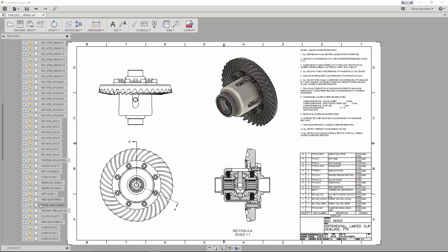If I want the outside gear final drive to not appear in the view but still appear in the parts list, I can hit the light bulb next to the component — it becomes hidden in the view but stays in the parts list. Hitting the checkbox will change the parts list and remove that component entirely. The checkbox suppresses, while the light bulb hides and shows.